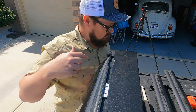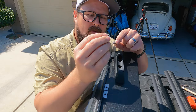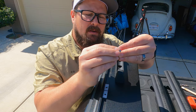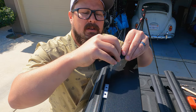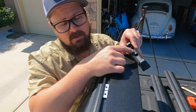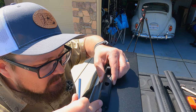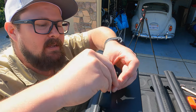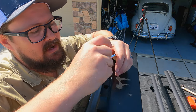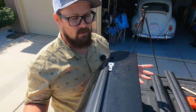Following the instructions, I take a screw, lock washer, and flat washer, and drop it right down into the mount. Depending on your specific setup, you may need to use the center holes or the wide holes — I'm going wide. Make sure you don't tighten everything down until you get both holes lined up, and keep it loose because you'll be sliding this back and forth to adjust position.